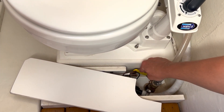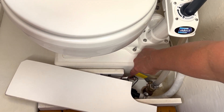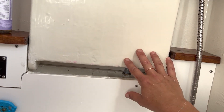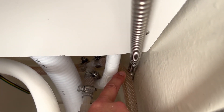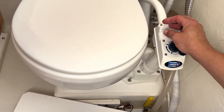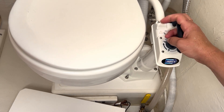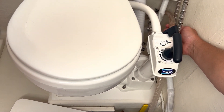There's an easy on-and-off lever right here — if we needed to turn off the water supply to the entire boat, it's easily accessible. The supply line goes behind here to the pump and then back out for the shower and sink. The toilet has its own supply; the supply line comes in here and tees off to go into the toilet. It's a manual handle to pump water from your supply system. If your inlet were across the boat or a long distance away, it would be a lot harder — you'd need a lot more pressure on this handle. We've kept it very simple with a T right off the supply line going into the toilet.